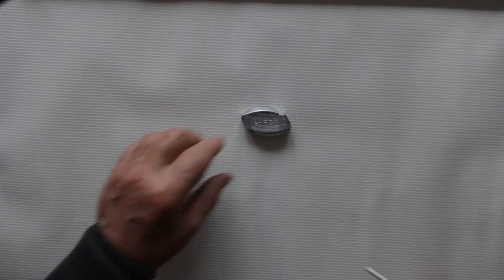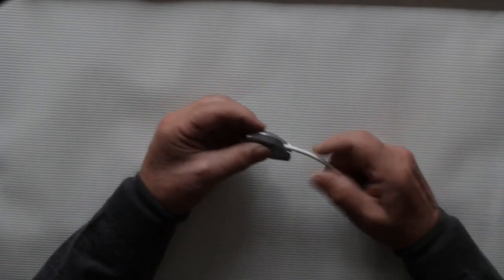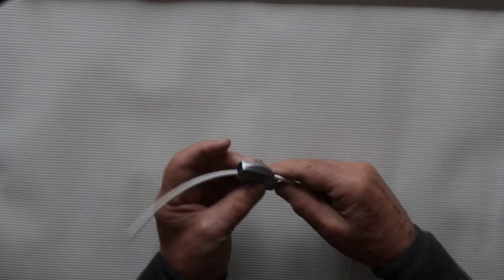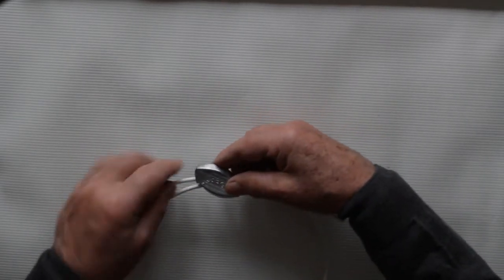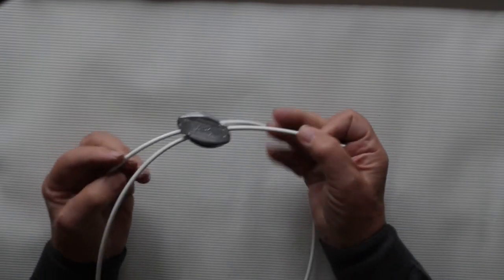And for extending the cable, starting a new reel or tensioning the cable, you put the end into the gripple and the new cable into the other end of the gripple and pull to take up any slack.